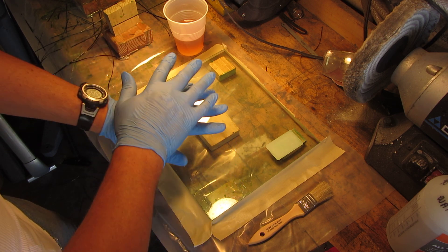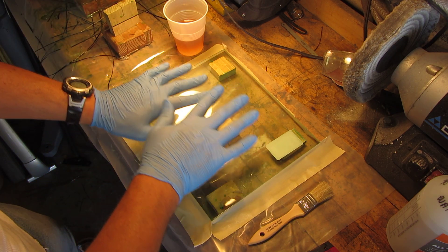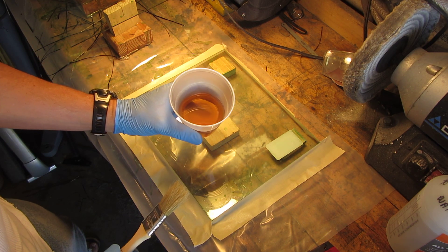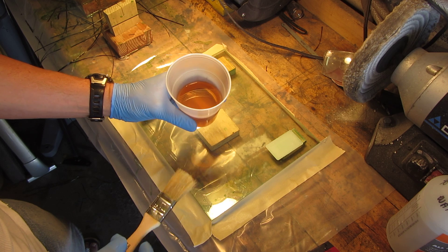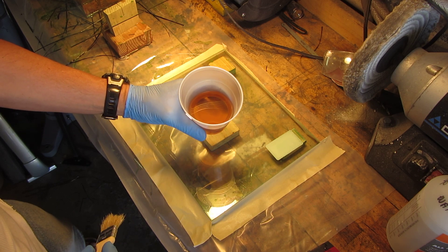The plan is to put down carbon fiber, then epoxy, put the other glass lid on top of it and then squeeze it out to make it nice and pretty. About 160–180 grams total of HTE has been degassed and you can see that it's nice and bubble-free.